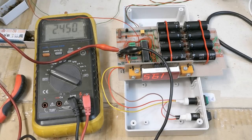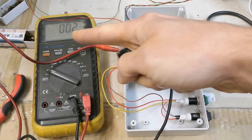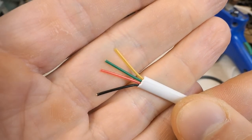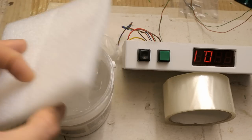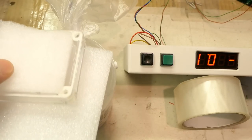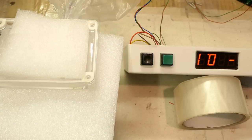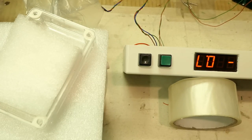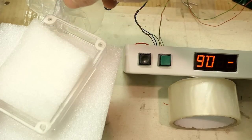I'm about to give it a probe. The voltage of the probe and the reference is switched — when you turn it off into standby there is no voltage. I like to use these temperature sensors. I need a three-wire cable; this one has four so I can double the zero-volt rail. The probe is trying the Wim Hof method in an ice bath. A different sensor from the bag is reading a little bit lower but also very close. You don't need 0.1°C accuracy just to know what clothes to wear. Out of 22 sensors tested, the worst two are +0.7 and −0.7°C; the other 20 are much closer to zero.